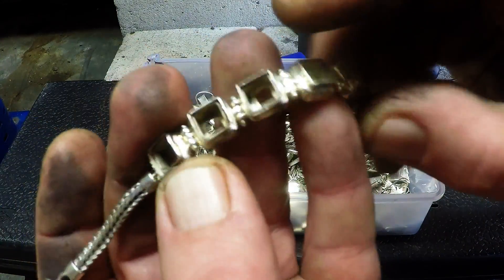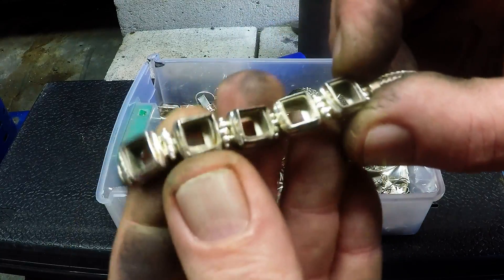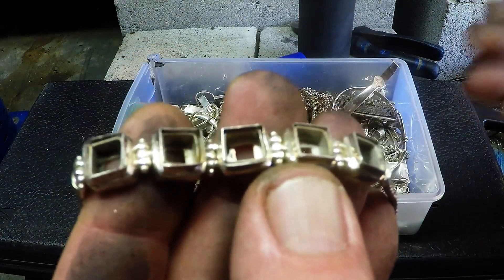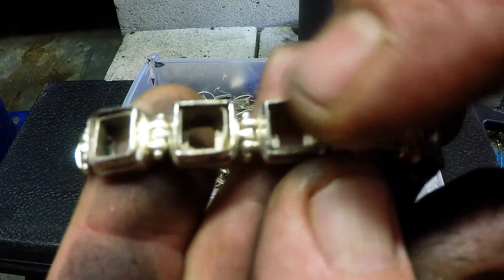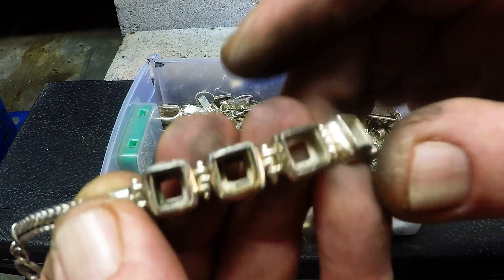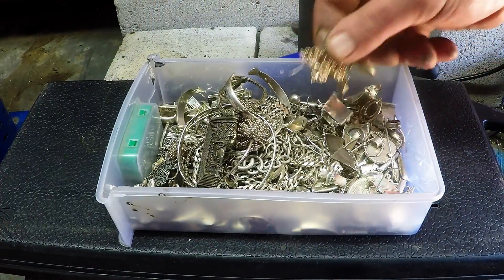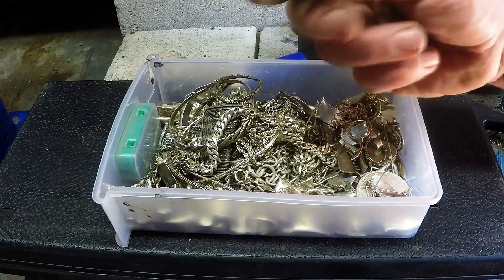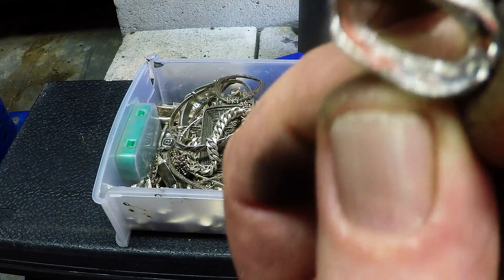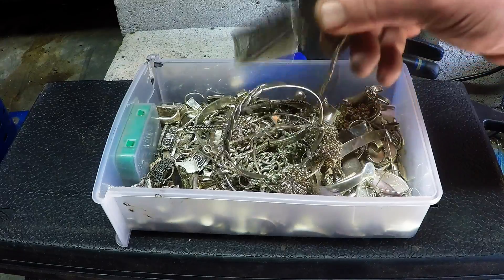Another thing — you can see all the holes in here where this had stones inside. When you're buying scrap silver jewelry, make sure the weight you're paying for is just the clean silver and not the rocks, because those add up to quite a lot of weight. You'll need to break the rocks out, and after removing them there's some residue inside, so you'll need some borax when melting to remove impurities like resin, glue, or fine stone particles. This ring here still has some brownish-reddish residue from the glue — that's got to come out in the borax.